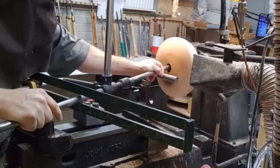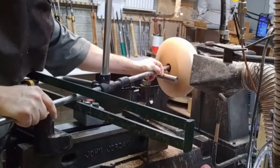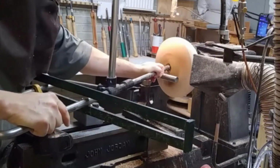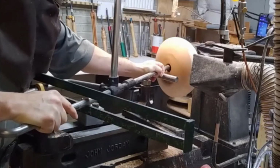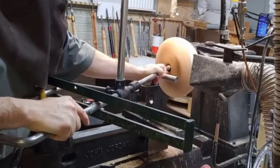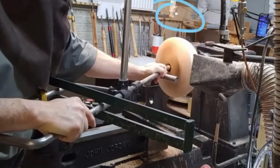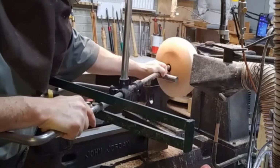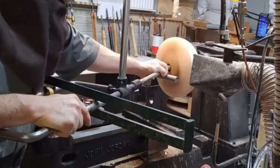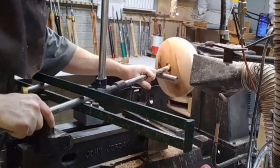Now I'm going back to a different view. I just wanted to show that this is actually out of sequence. This is where I'm hollowing more of the middle, the initial roughing out. But I wanted to show again that the vibration is evident, but it's not nearly as bad as it was when I was working way off at the outer diameter of the piece. This is where the smaller diameter portions of the swivel tip of the Jameson bar are not being stressed.